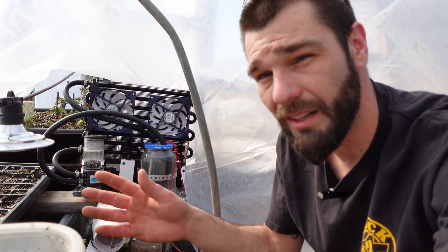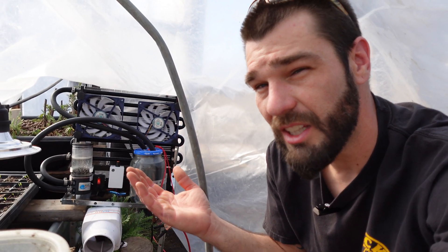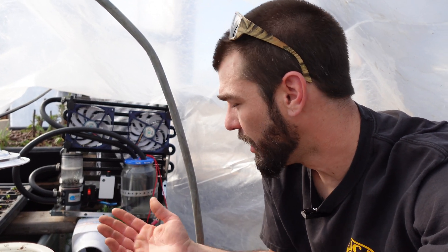We are doubling down and reworking this solar system — we used to have this hooked up to a box outside with sand and copper running the same solution through it. When we mix vegetable glycerin and water at 33% and 66% respectively, we are lowering the specific heat of the water and the solution becomes a little thicker. It's able to pick up heat easier and still has a high specific heat, giving us a gel-like liquid that moves through the system, doesn't bubble much, picks up the heat, and won't freeze but carries heat very well.